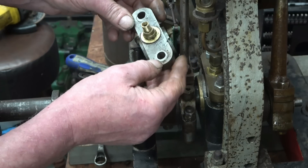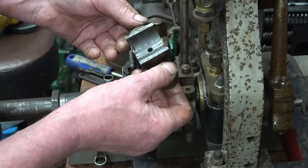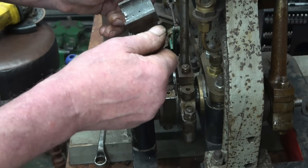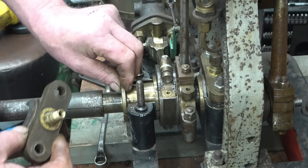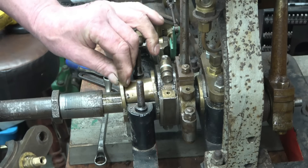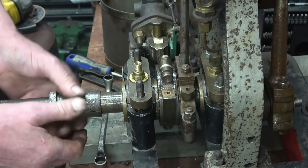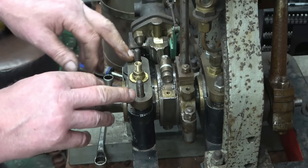That's strange how those holes have been slotted - they've had inserts put in there. Whether something's happened to the original one or what, I don't know. It certainly fits and certainly does the job, but it's interesting to see what's happened there. These will go back together with double nuts on, because there's a clearance on that bearing there - that lift on the crank - and that's taken up by double nuts. It's interesting the way that's been - not bastardised, but sort of repaired somehow.